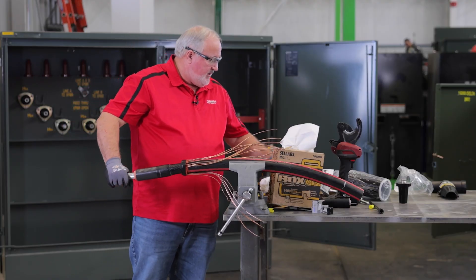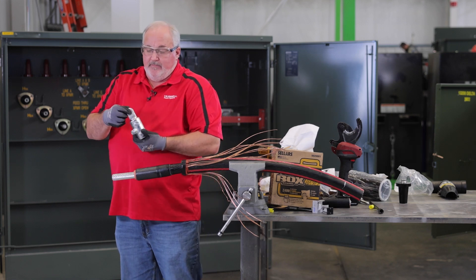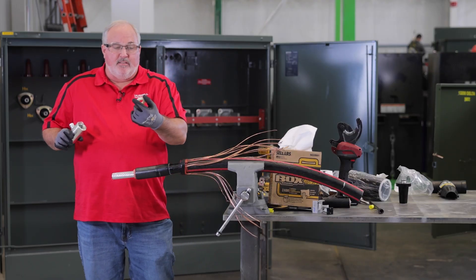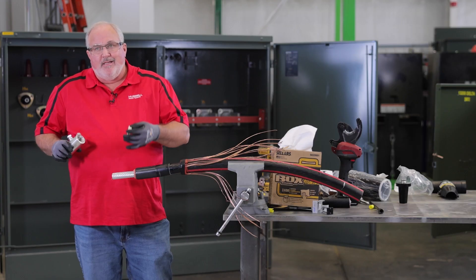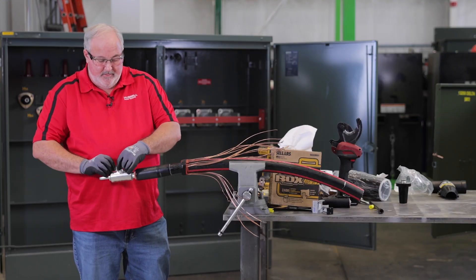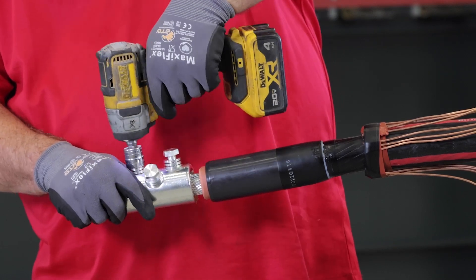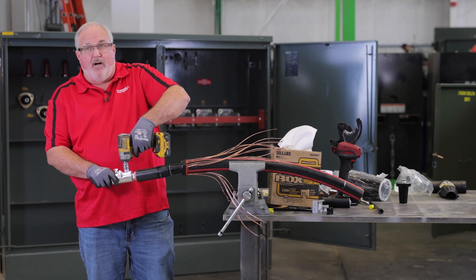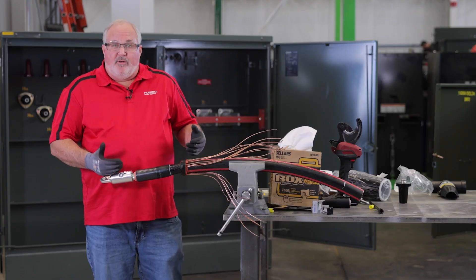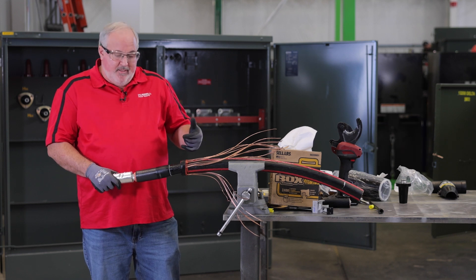With the silicone placed, now we want to install our connector. You want to make sure you orient the connector with the flat side facing the equipment bushing. Wire brush your lug. Some shear bolts come with centering rings — check your instruction sheet. If the instruction sheet requires a centering ring, add it; if not, the centering ring is not necessary. Put your connector on and make sure it's all the way bottomed out. Snug everything up and then break off the shear bolts, starting from the bottom one working toward the top. If using a compression lug, make sure you're using the right die, the right tonnage crimp tool, and the right number of crimps for that application.